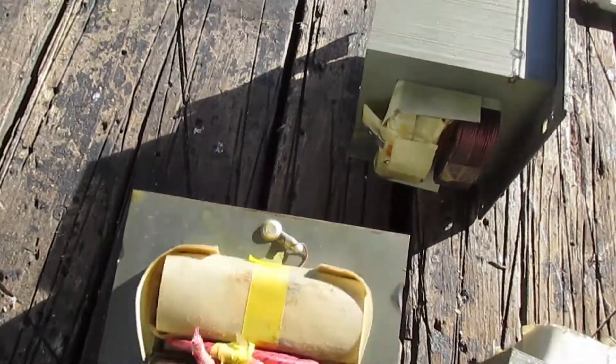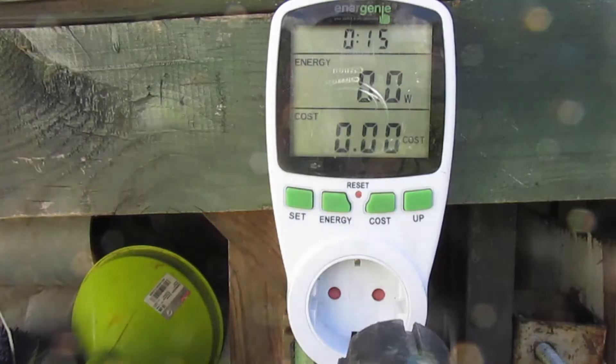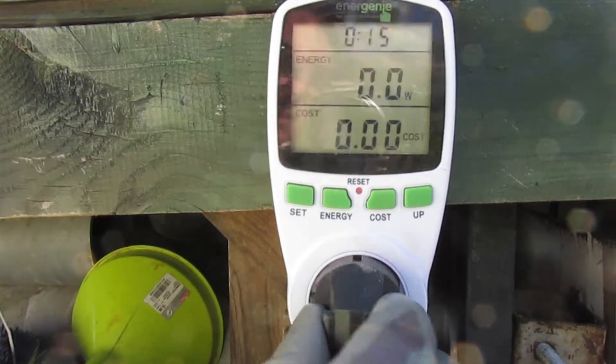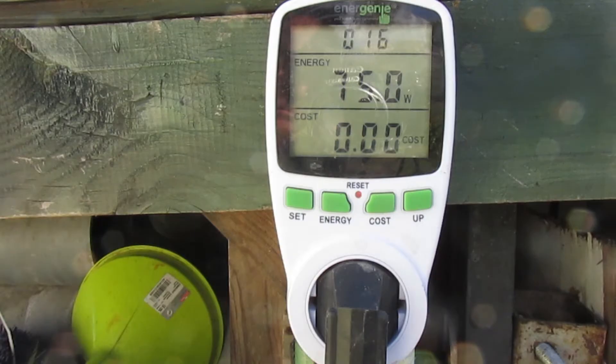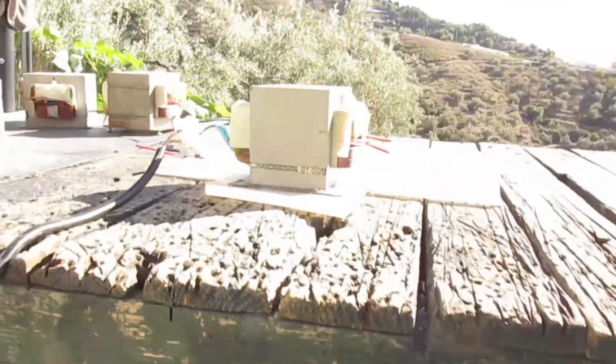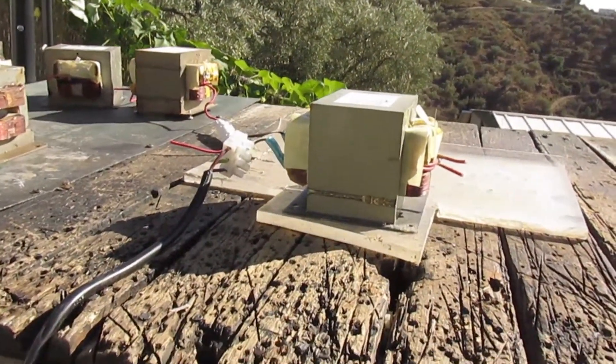Back to this one — I need 3,000 volts today, I don't need 1,100. Let's see what kind of power the thing is drawing with no load. Okay, 75 watts is disappearing — in heat. That will be the transformer just warming up. 80 watts and climbing. Essentially that's all wasted, considering the transformer is literally just sitting there with nothing connected to it.